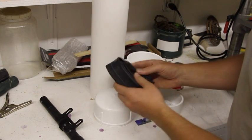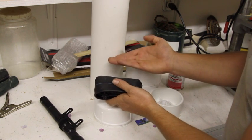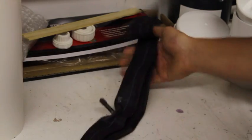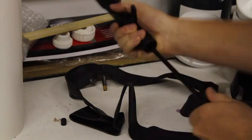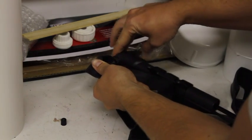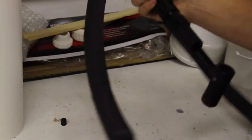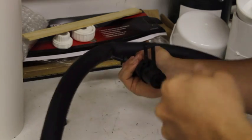I like to use a rubber inner tube partially filled with air so that even if water starts to seep up in the tank, this will prevent it from becoming totally waterlogged and the pump will still operate. Typically I start with the inner tube — just remove the cap and put some air in. I've had questions from people asking how much air should go in the tube. Just make sure it's full but not so full that you can't bend it in half, because this has to go into the tank. If it's too full, it won't fit.